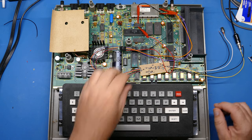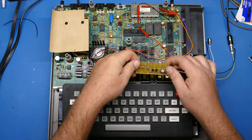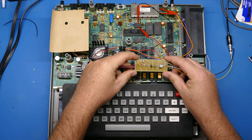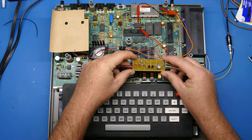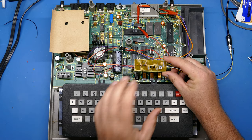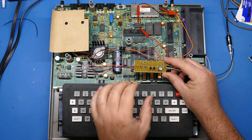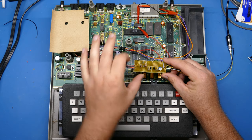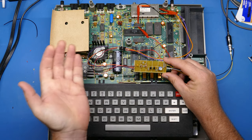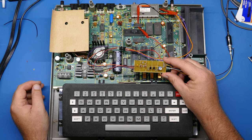All right, so I'm back at the bench, and this is the board that I set up. You can see there's not a lot of components on it, actually, and it's fairly large. Normally when you would do this type of board, you'd be able to squeeze this down to smaller components. And like I said, if you were going to have this PCB manufactured, you'd probably be able to get by with like half an inch by an inch, because all of these could be essentially SMD components. It could be really, really small.